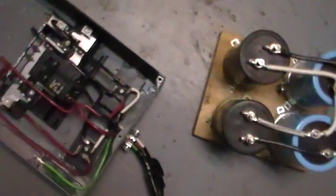We'll go through the box here quickly and see what's going on. It's squatting down on the floor — here come the two power lines into the box from the pigtail. They go into the breaker, and from the breaker they go into the bus bar that the breaker sits on. One here, coming up into the bridge rectifier. And the other side — bus bar — and here's the other side going over into the corner, feeding up into the bridge rectifier.